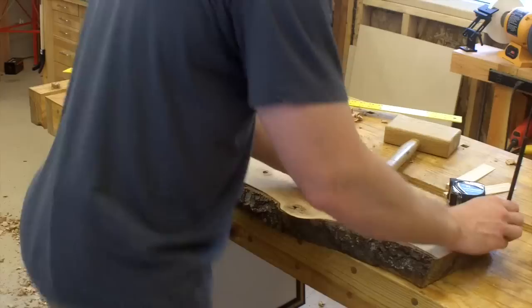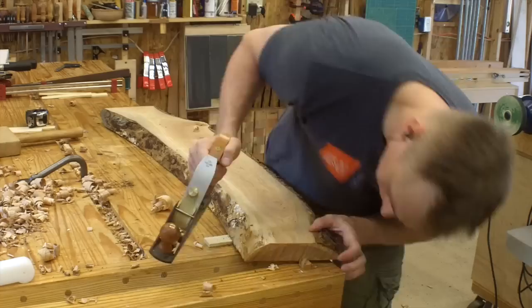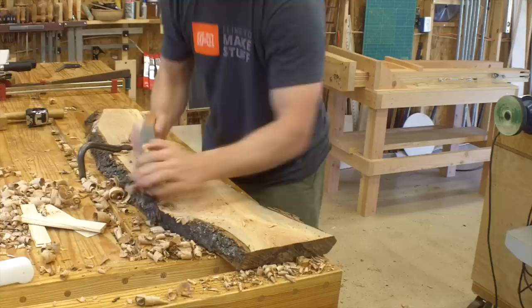It's hard to do this all at once, that's why I like to mill it up with the planer first. So I mark out how much I need to take off both ends to get rid of that bowing, and I take this out with a scrub plane as well. The twist was excessive and took longer than normal, but this is really only about five minutes on each end with that scrub plane to take that bow out of the board.